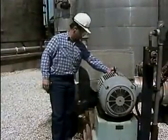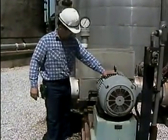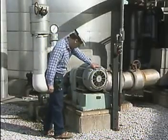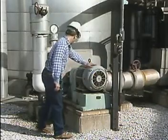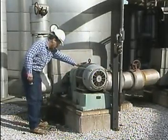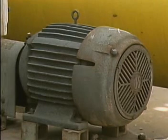You may also be able to detect excessive vibration, which is another common motor problem, by carefully feeling the motor's casing. You should also look over the motor and the equipment it's driving for anything unusual, such as sparking or arcing, which could indicate a short or an open. In addition, listen for unusual sounds. A properly operating motor should make a smooth, steady sound. Excessive noise, knocking, or popping can be a sign of a problem.